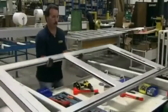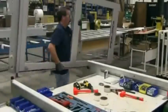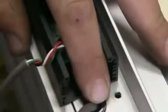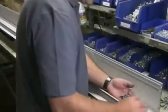Workers complete the door structures by applying legally required safety decals. Meanwhile, at another station, workers install the door's electronics in the header. This is one of many infrared sensors that trigger the doors to open — the sensors detect people approaching by reading the invisible heat energy humans give off. After loading the nuts, they fasten the remaining components to the header's track and install a pulley, part of the drive system that moves the doors.